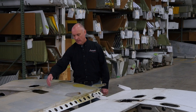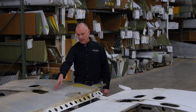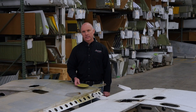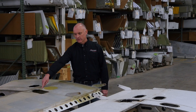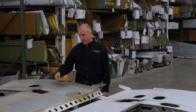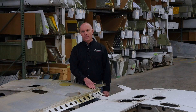Piper Service Bulletin 1304A calls out for the installation of the access panel in one of four quadrants on the lower side of the wing. The quadrant is defined by the main spar, the rear spar, the fuselage, and the landing gear. I have a rib right here at the fuselage, one rib right here, one rib just inboard of the landing gear, and a stringer running inboard to outboard right here — so I call these quadrants one, two, three, four. On the taper wing aircraft, Piper installed that panel just inboard of the landing gear, where there's a pulley bracket, affording easier access for putting control cables in. For the inspection purposes of the service bulletin and the AD, we like to install this panel just outboard of the fuselage, which gives you a good vantage point to inspect the aft side of the main spar for corrosion and the rear spar for corrosion, right where the steel attach plate is fastened to the rear spar.